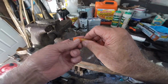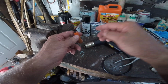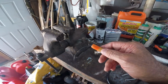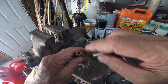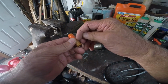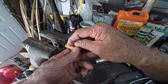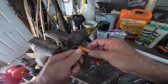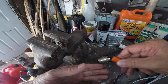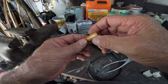But after I cut a bunch of these, say 20 of these, and I've done the 1/8 inch drill on both sides, I take the thing out and I put a chainsaw file in my drill motor. And that's what the size of a chainsaw file is. So then, say my 1/8 inch don't exactly center punch each other identical. No big deal. But you're going to put that chainsaw file in, and you're going to just hold it by hand and slide it right over. Let it go clear through and just run it in and out a couple times. Done.